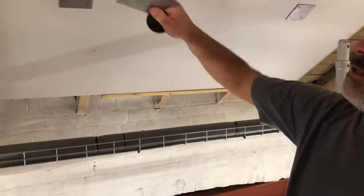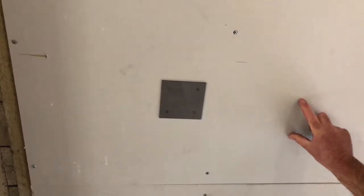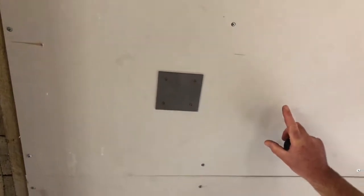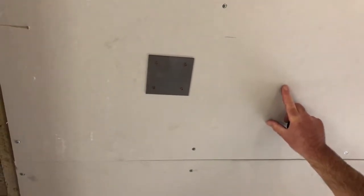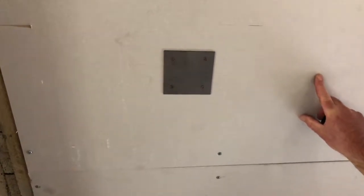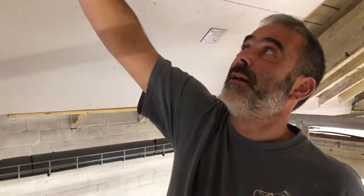The plate is very simplistic — there are just four screws. Then it's a matter of what we're fixing into: whether we're using a plasterboard plug, a rawl plug, or if it's masonry, a masonry plug. It's just a case of working out what your substrate is and what we need to attach to. Overall it's a very simplistic, very neat system.